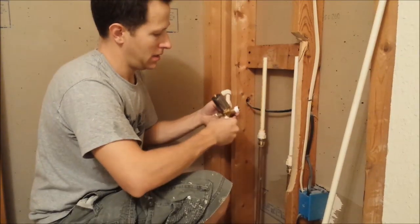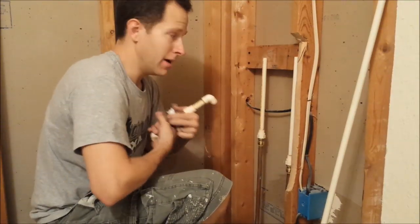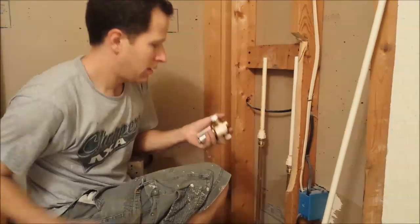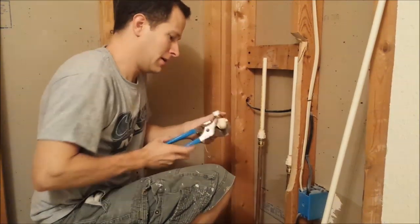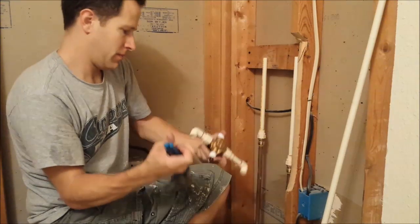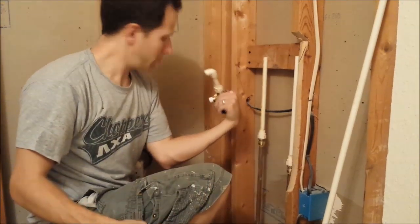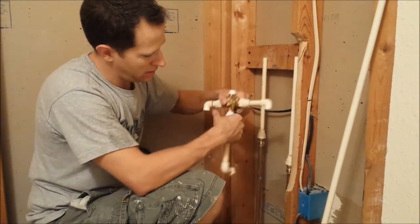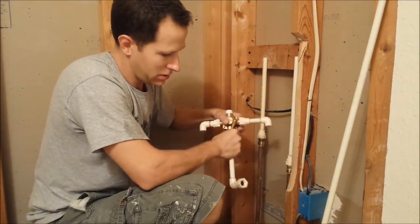I'm going to attach all these screw-in fittings first because it's easy to do right now when everything is detached — it becomes a lot harder once I get it on the wall. Not to mention I can just drop this down into place, whereas once it's on there I'll no longer be able to spin the whole assembly. Don't forget to do the tub fitting as well — this is the bathtub filler. Because this piece sticks out you won't be able to spin it behind the wall, so that would be a pain to do later.